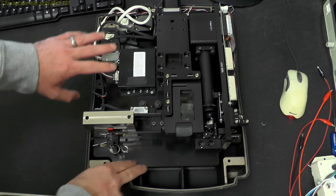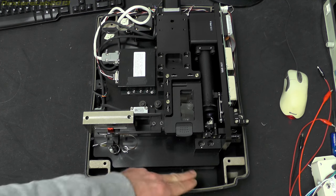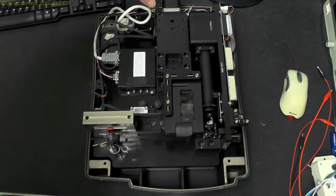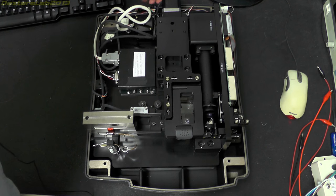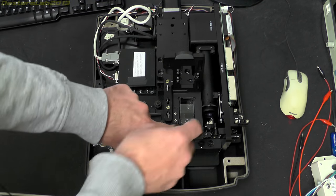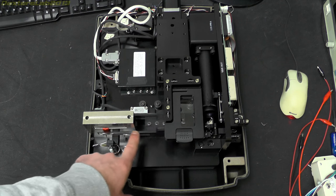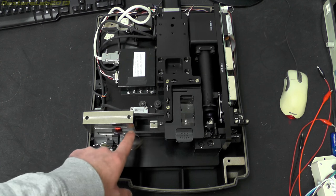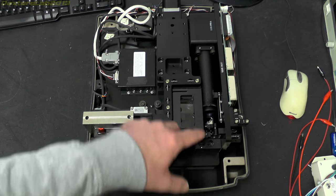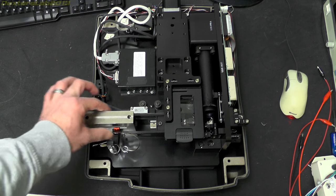Everything from here upwards is all mounted on this large aluminium plate — it's about 17mm thick, beautifully machined and finished, really solid. Right in the centre we have one of the axes — this is a moveable arm which is on a linear actuator with a stepper motor, so that moves in one direction. We have the actual place where you put the slides in, and for the other axis we have a voice coil which allows another linear arm to move backwards and forwards. Given that this works down to 5 microns, the tolerances on both these axes are going to be quite amazing — these things certainly wouldn't have been cheap.